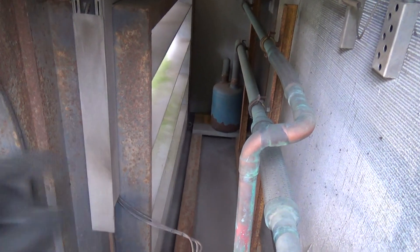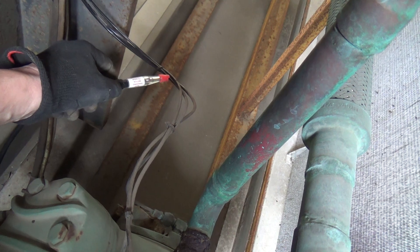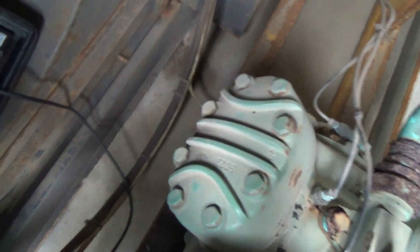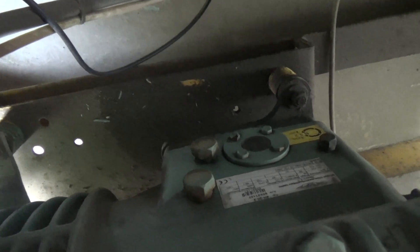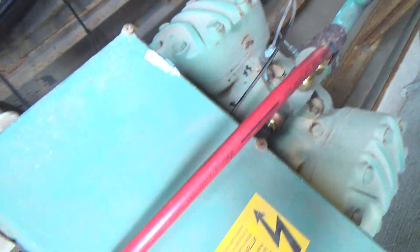Look cool there — I think it's just dirt. Get some spray around that, then we'll pop the cover off. I've been over these and I can't find a leak on them. I'm wondering because they're plastic whether they get porous, because the detector thinks there's something there. I've put spray on it and all sorts — I can't see anything. And then that plug which was going mad earlier — we're not getting anything on that now. I'm wondering if that's because the block's cooled down and the metal's tightened up a bit. But we were definitely getting something off it before, as we've had the power off for an hour or so.